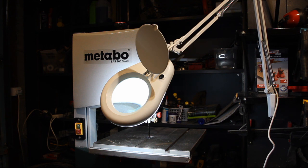So, cutting the teeth on the gear wheels. When I first started the clock project I experimented with various methods — I tried the router on the router table, I tried a scroll saw, before hitting on the technique I use now, which is a band saw. Here you can see the setup: it's just a small bench-mounted band saw with the extra attachment of a magnifying light.